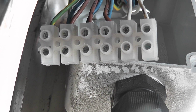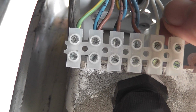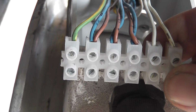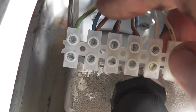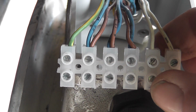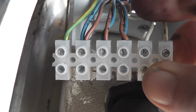This is part of the pre-checks before we start doing anything on converting this motor, and just have a look at this. You've got an earth wire here that should be grounded, that's on the casing. This one has three sets of wires here. At this stage the motor looks like it's delta wound, so that's the three phases basically. We're going to use one set of these for the 240 volt supply, and the other one is the spare floating wire, which is for the capacitor to create a field. These two white wires might be for a tacho.